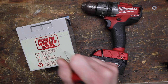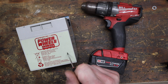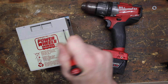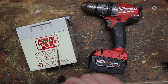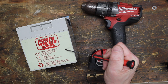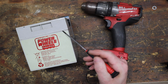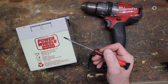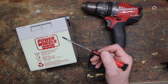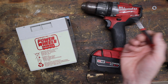This is a typical Power Wheels vehicle battery — a 12-volt, 9.5 amp-hour lead-acid beige brick weighing about 10 pounds. It has pretty draconian charging requirements: an initial charge of about 18 hours out of the box before any use, and then 14-hour charges after each use. From what we were able to get, that gave us about a 45-minute charge at best.